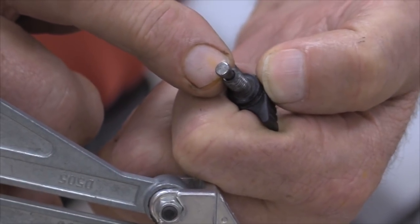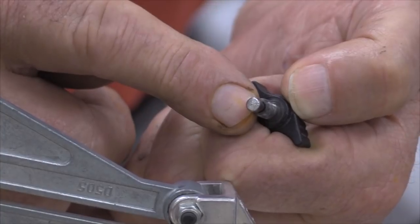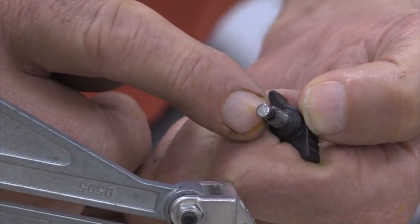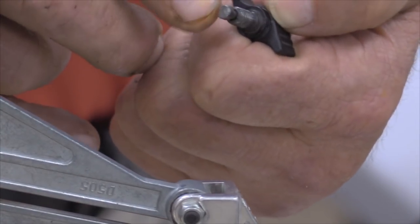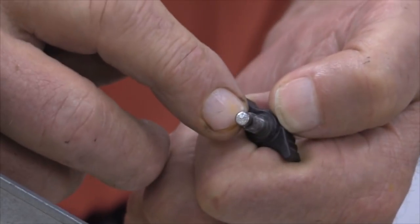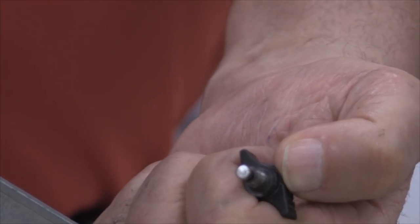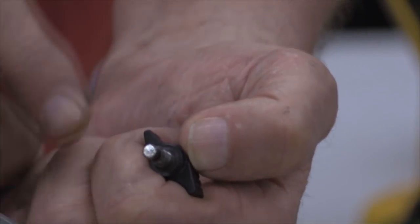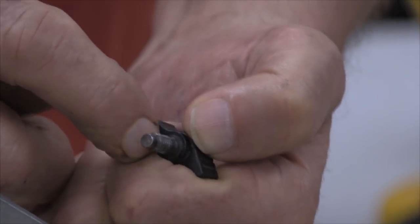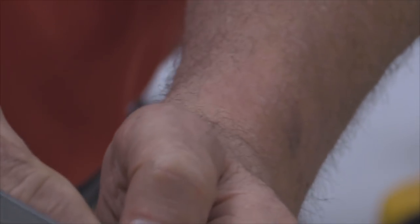Now, what I'd recommend you do, if none of you at home have dealt with this before, is you pull that little rascal out of there, and there's a little O-ring inside there. I would recommend putting just a tiny drop of mineral oil on there. Other types of lubricants, petroleum-based lubricants, will destroy the rubber O-ring. That's why I say use mineral oil instead. What that will allow it to do is, once you get the thing reassembled, that anvil will still turn.